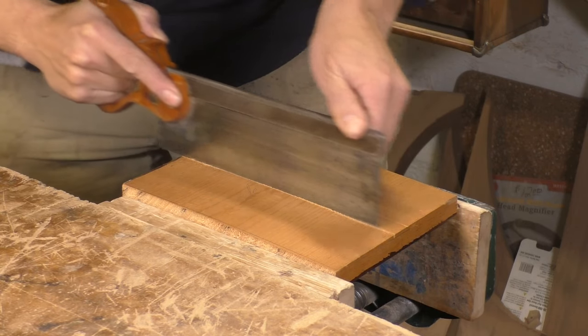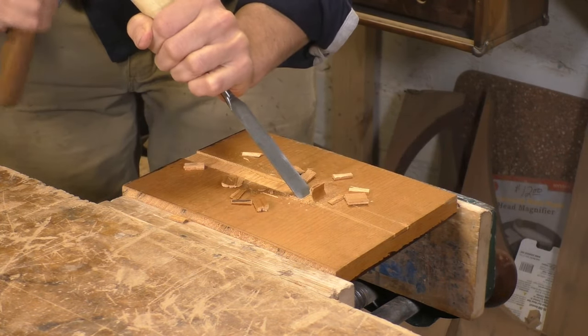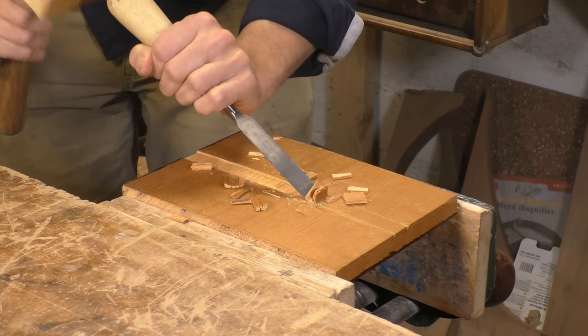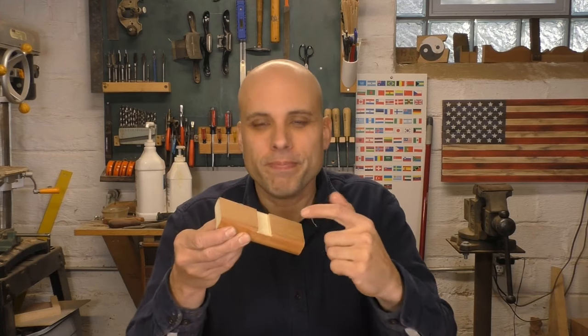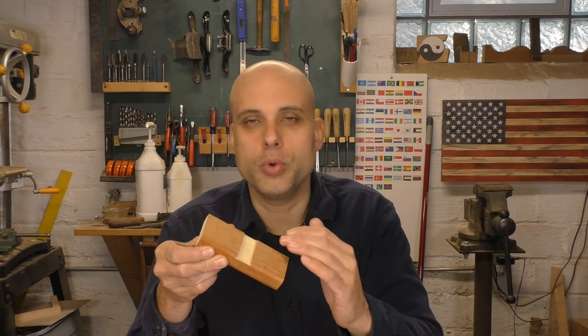What's great about these joints is that you can cut the sides with a nice saw and then take all the waste out just with a simple chisel. They're very easy to cut, but once you've got that waste out of the middle, you might have some trouble with the bottom of the joint. It might be tough to get it smooth or even, or to get it to the exact depth you want — just free-handing it with a chisel cut.